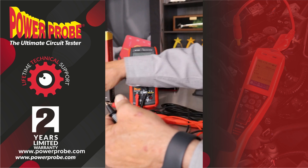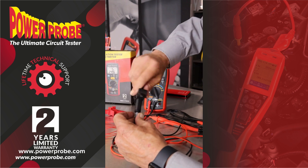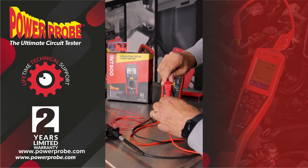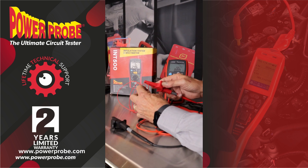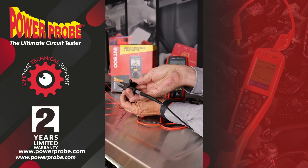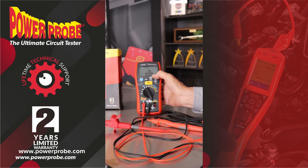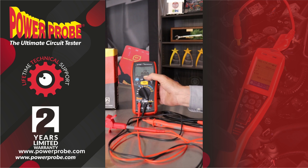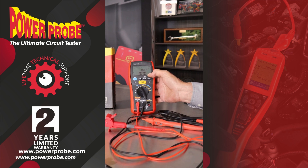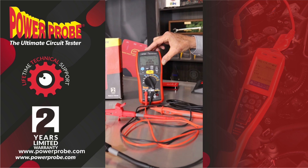So once you're zeroed, you can go ahead and test. We'll do this piece of wire — I'm going to use these clamps here. This is a five foot of 20 gauge wire, I'm going to clip on both ends and hit the test button. It's less than 10 milliohms, so that's as low as I can measure. Anything less than 10 milliohms you'll get that zero zero zero on display, but it's actually a loaded 200 milliamp test and it'll give you readings down to 10 milliohms.